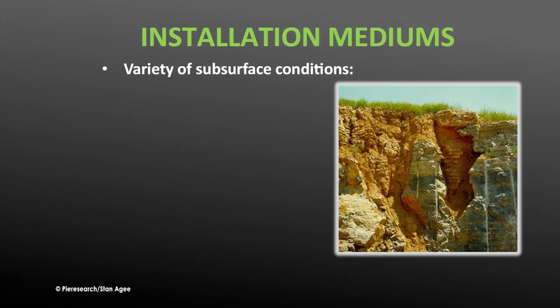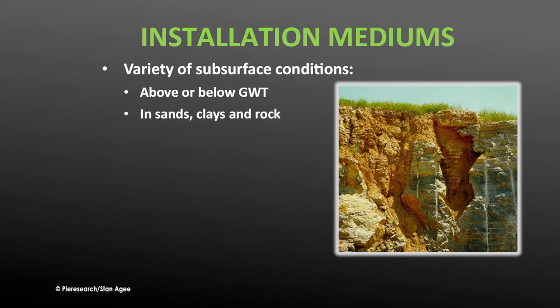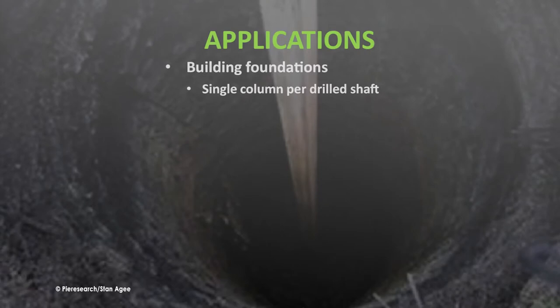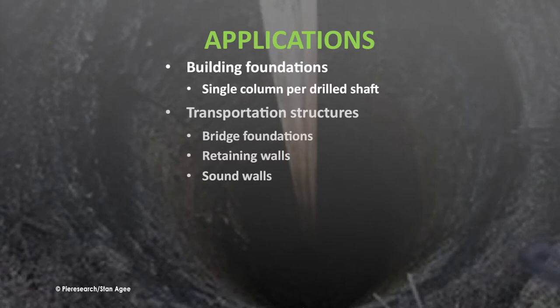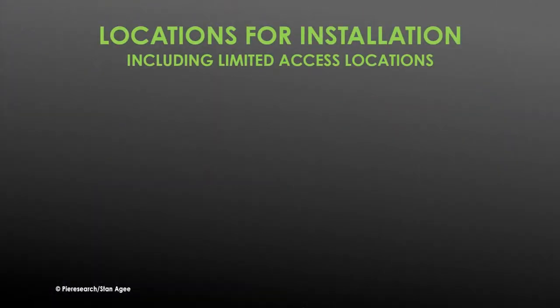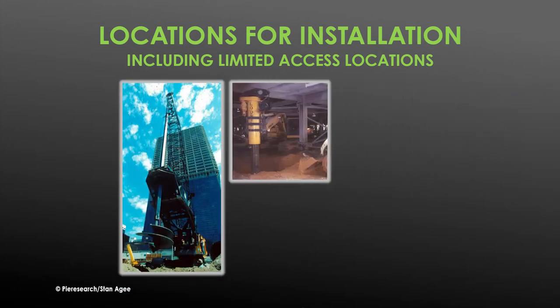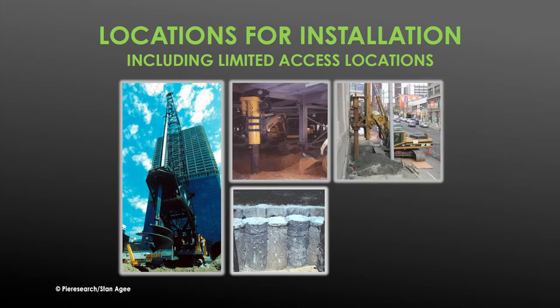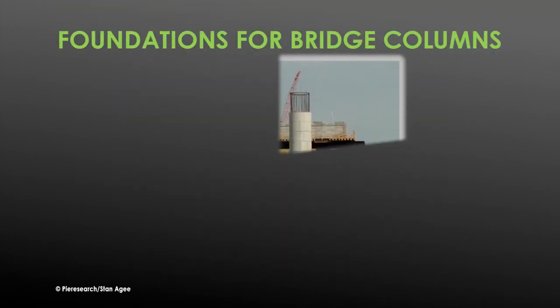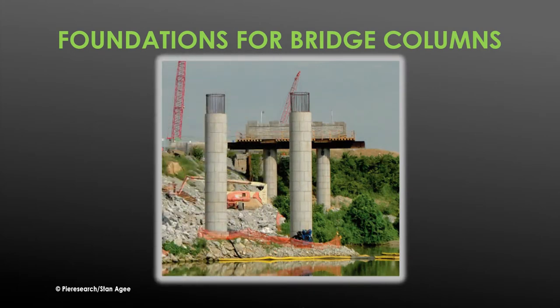Drilled shafts can be installed in any type of strata above or below the groundwater table, including sands, clay, rock, cobbles, karst, collapsible soils, shrinking and swelling clay, compressible strata such as soft clays and loose sands, and even liquefiable soils. Applications include individual shaft constructions for buildings and bridges, multiple shaft constructions for retaining walls, sound barriers, underpinnings, slope stabilization, and seismic loading. Even in very loose soils, drilled shafts may be used adjacent to foundations of buildings that might be damaged by pile driving vibrations, and shafts can be drilled in patterns to create walls and barriers. Drilled shafts are also used to create foundations for bridge columns throughout the United States and around the world, even in marine environments, to transfer loads to bedrock.